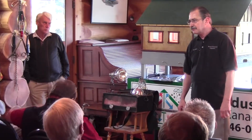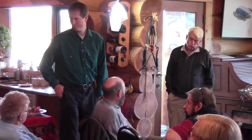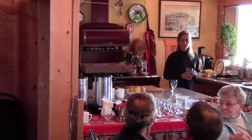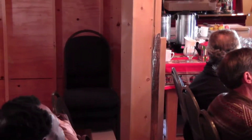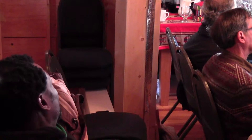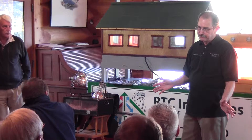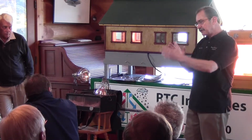As you can see behind you here, Derek has done this nice little demonstration of using this on the outside with your rain screen to show you how this can be put into new construction. If you go to the other side, you can see how it could be put into renovating buildings. The material always has to go to the outside, because not only is this a tremendous reflector and insulation, but it's a perfect vapor barrier.